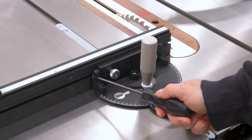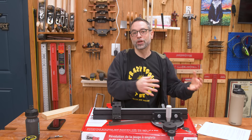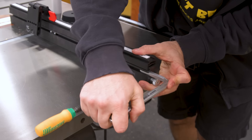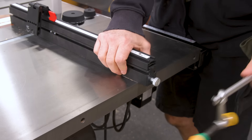My favorite part is that the micro adjuster goes along for the ride with the fence extension. One of the few things I didn't like about the Jessam is that the extension doesn't allow the micro-adjustable stop to go along with it — when using the extension you have to use a little built-in stop that slides in and out. The fence has a dovetail slot instead of the T-slot seen on pretty much every other miter gauge. The good thing is you can use the dovetail nut pieces they include. The bad thing is you can't just use quarter-20 hardware for your own work-holding solutions. But you could make a sacrificial fence with a dovetail slot — no modification needed, and you get the sacrificial fence you probably needed anyway.